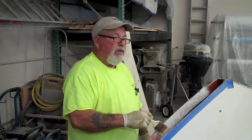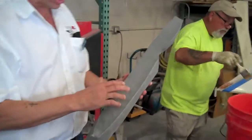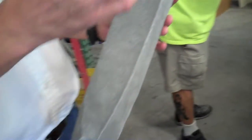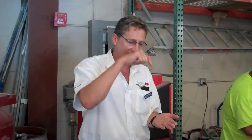It won't snap off. And if you also look at what the Coosa board is — this is Coosa board. You can get this in all different kinds: you can get this in 24-pound, 6-pound, or 14-pound. It's compressed fiberboard, waterproof. You can tap and screw right into it. So we use this to reinforce the inside of that arch, as Steve had alluded to here earlier. And that'll tighten it up and strengthen it and give it a good base for us to tap and drill our stainless steel hinge in.